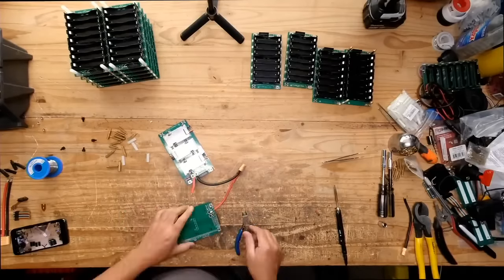Okay, so I'm gonna check here. Oh, look at that, it shows 59 volts. And it shows volts, even though it shouldn't, right? Because the BMS should be off. Volts, but I bet you that's not gonna be real voltage. It can be.